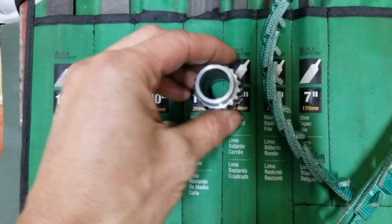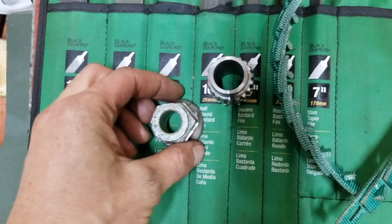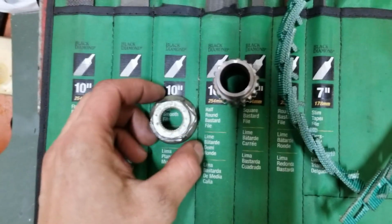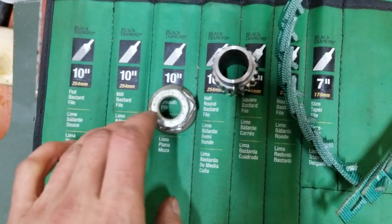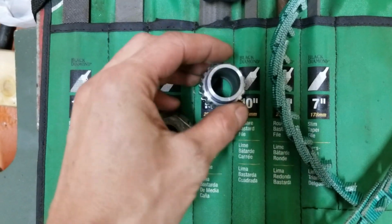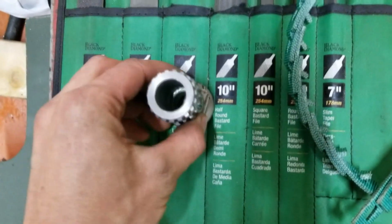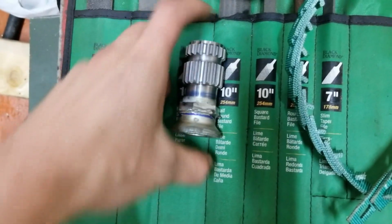Yeah, I figured. Where did I write that? I wrote everything down, all the measurements that I took. Yeah, I need to machine the outer diameter of this down and then the inner diameter of this out, and then press it in and then weld it. So that's up next. That's going to be pretty exciting to do.